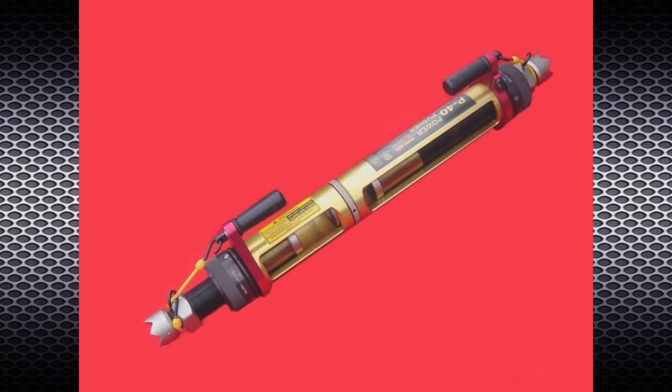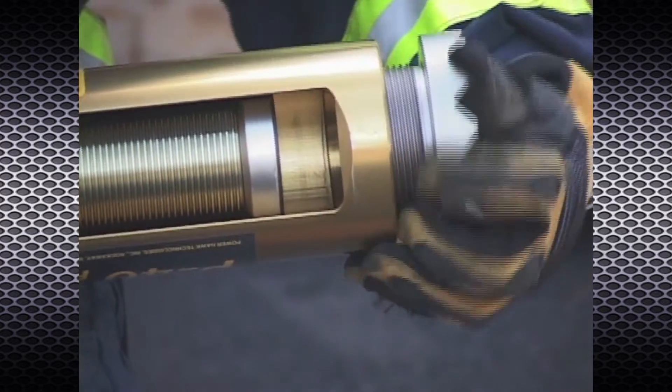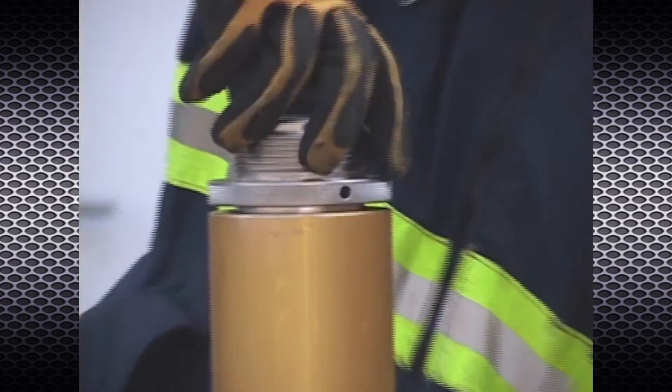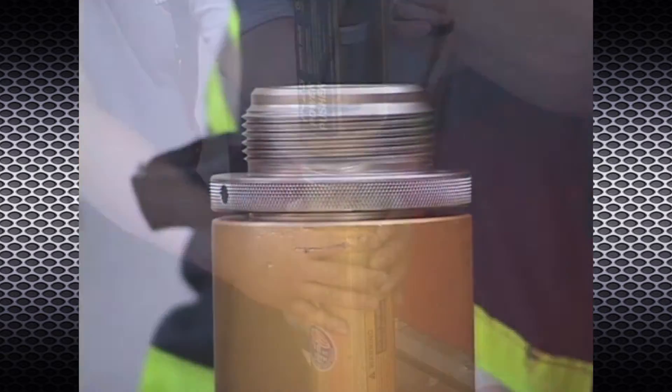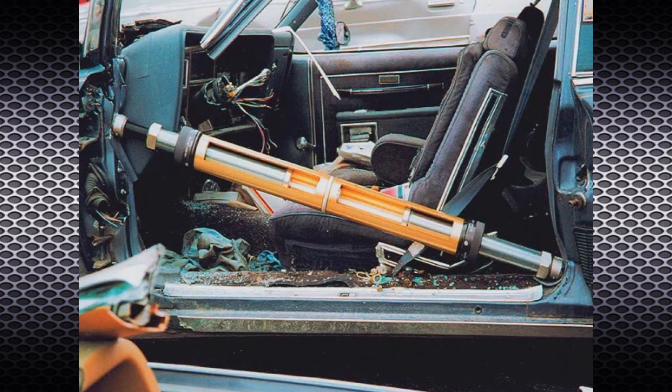Using the RAM coupling, two Power Pushers may be assembled back-to-back. This increases both the reach and the stroke of the RAM. Remove the foot adapters from the two Power Pushers that are to be assembled. Screw the RAM coupling into the base of one of the RAMs and leave a slight gap between the coupling flange and the RAM housing. Screw the second RAM onto the coupling and align the slots for easy access.